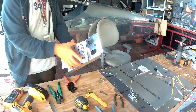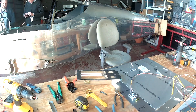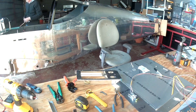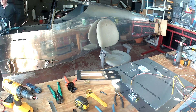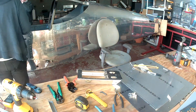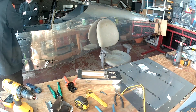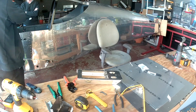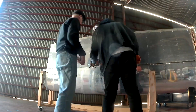We're going to splice the CAN bus in, then bring it back down the wing — which it already was — but we're also bringing the two power leads from the magnetometer down. Then we'll connect it all up at the wing root and connect the G3X system to the CAN bus that's in the wing, just like I demonstrated on the workbench.